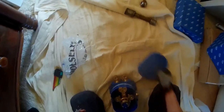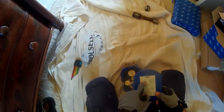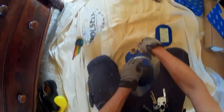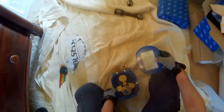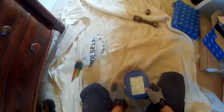This is what you get when you simply buy the unit — you get this box. It's all very fancy and it comes with a special sacred magic Grohe cloth to stop the plastic from rubbing in the box. You get this cover and you can see how it's orientated A and B — these are ports A and B. I've got a couple of BSP elbows round into them because that's how I'm going to connect them up. The inputs tell you which side is which: hot on the left, cold on the right.